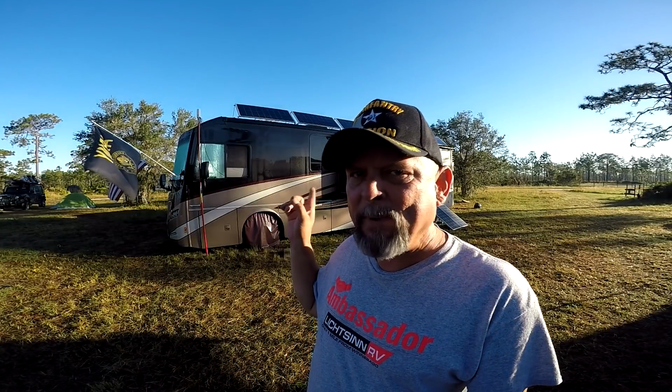It should be obvious from what I've shown you already that if your goal is to be able to boondock in places where they have quiet hours from 10 p.m. to 8 a.m. and you don't want your generator to run during those hours, it's not about having solar power to make that happen. What it's about is the battery bank. The larger your battery bank, the longer it's going to last. So if you can make your battery bank large enough so that your generator doesn't have to run from 10 p.m. to 8 a.m., then you have accomplished the goal of meeting quiet hours. So it's the battery bank that's important in that scenario.